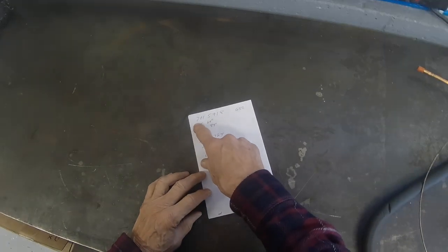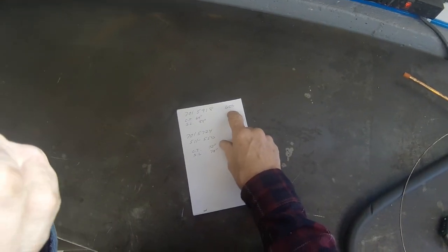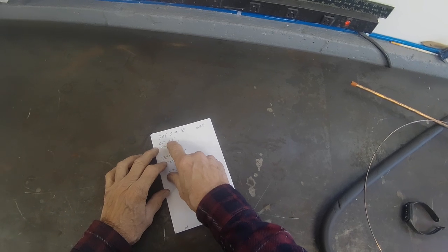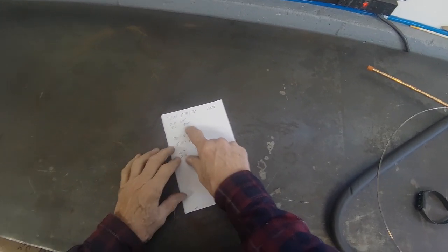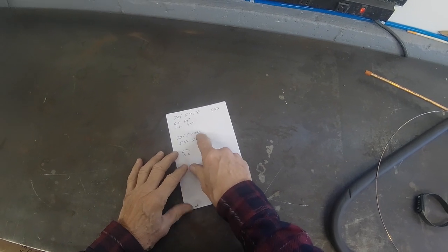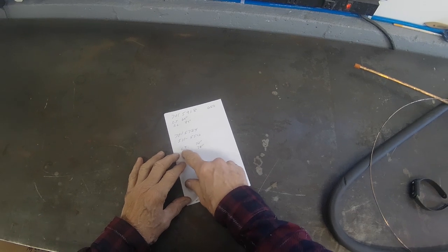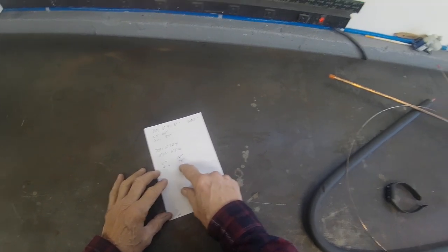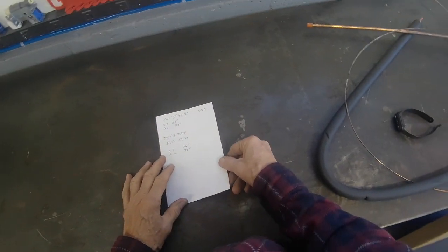Here's what I came up with. I hope you can see this. The 701-5918 is for this model, 650 here. The length of the cap tube is 64 inches, and the length of the suction line is 84 inches. On the 701-5724, which is set for a 511 and a 550, the cap tube length was 72 and the suction line length was 78. So there's quite a difference in there, and that's the reasoning.